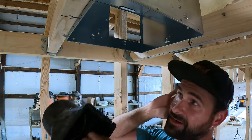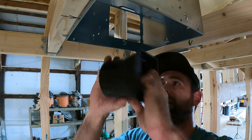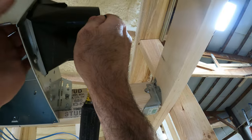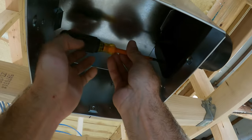One of the things that I like about this fan is it's got a four inch vent and the fan itself is an 80 CFM fan. That little baffle slides in there like that and then it can screw in.